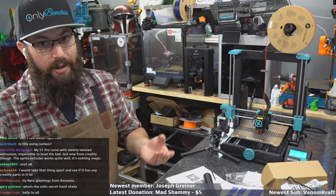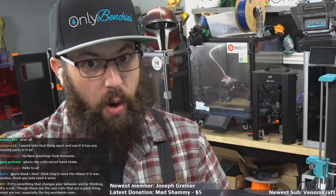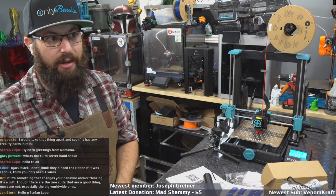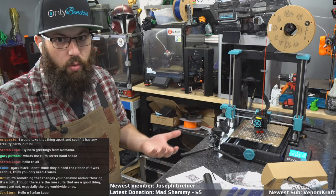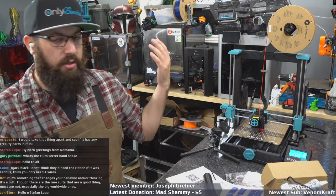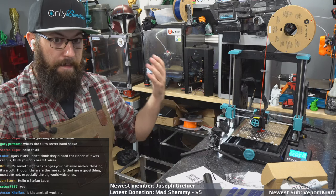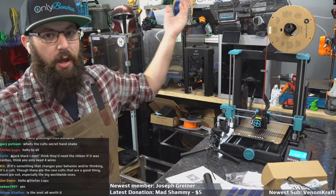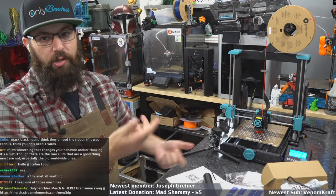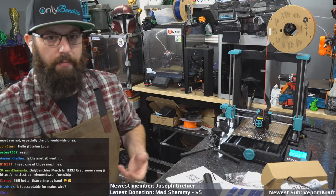Is it the right way to do it? No. Is it the wrong way to do it? No. It's another way to do it. In terms of best to worst, it's not the best, but it is an acceptable practice. It is a thing to tin your wires. Now, over heat cycles, there is a potential it can loosen, though not in all environments, not all wires, not all connections. It is nice to see ferrules. But this is why: they buy wires by the 100,000 to millions, pre-cut, pre-made by a machine, and some guy making minimum wage on an assembly line in Shenzhen is just slapping these into a machine. So it's not that they're unsafe, they're just using the cheap mass production method.